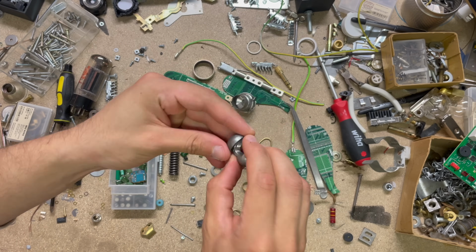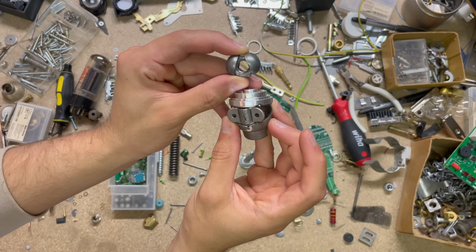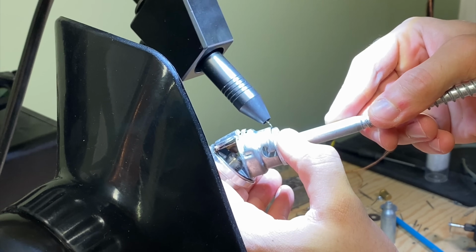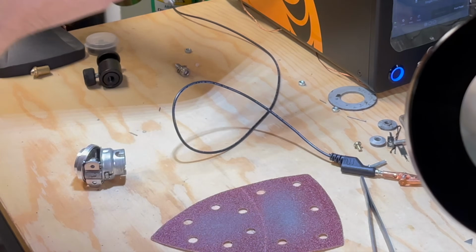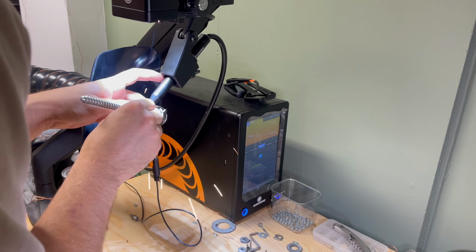An old nut works as a way to space them apart and would hold them at the angle I wanted. This looked good with the thorax, so I went back to working on the abdomen as a form of procrastination. At first, when I tried welding the parts together, I wasn't actually getting anywhere, and I figured this might be because the washer had some sort of plating or finish that was stopping me from getting a good weld. I sanded it down and this seemed to fix it.